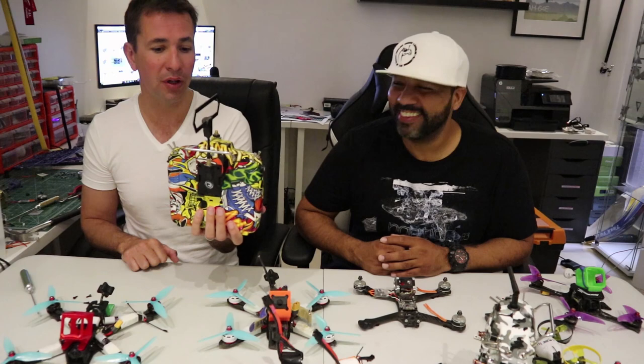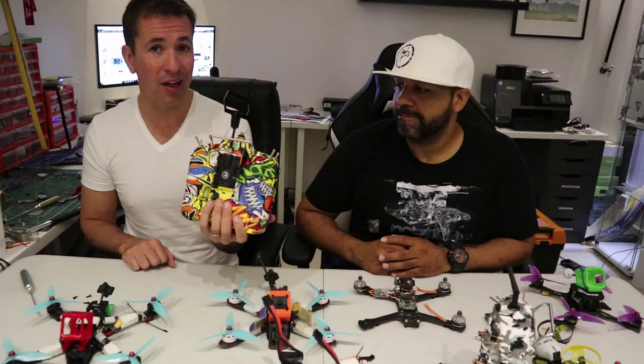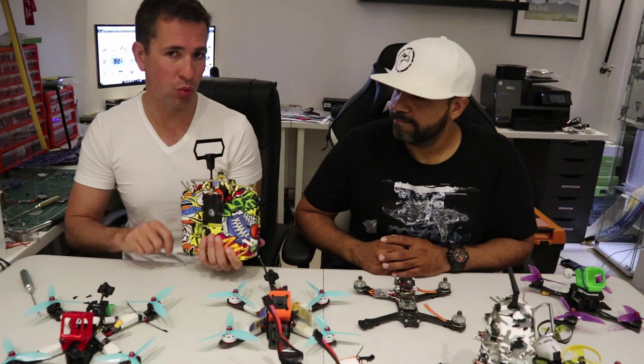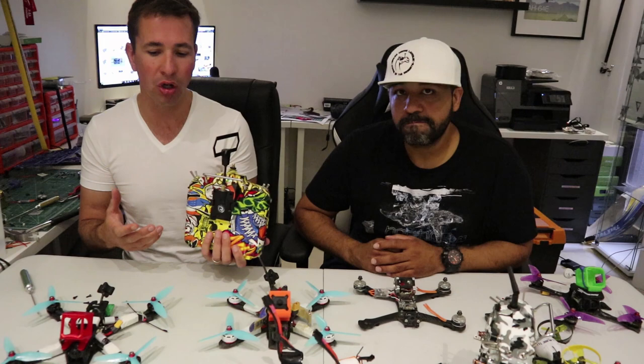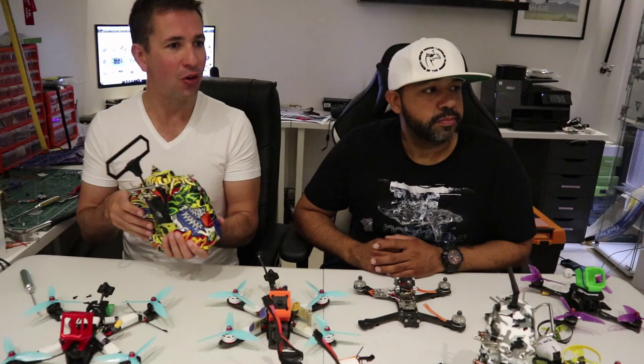900 frequency, 900 megahertz. And this guy will easily push you out more than a couple of kilometers, past what your video transmitter is going to put out. So as you start to go out, you're going to lose your video before you lose control of your quad, which is really what you want. You don't want to lose control of your quad and still have a perfect video, because that just means you're going to crash. But so that's Crossfire on UHF.